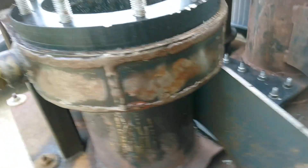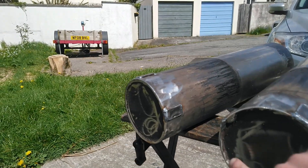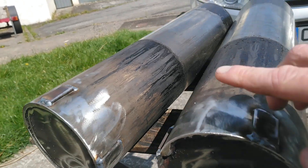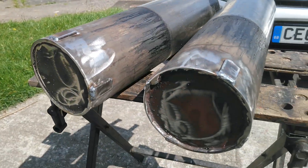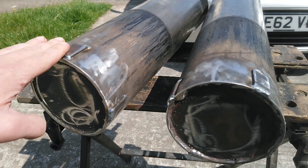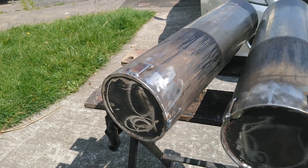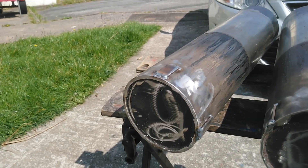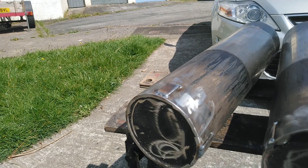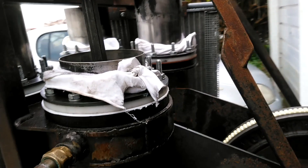I'm going to go ahead and cut these skirts off. I've actually cut the skirts off now - they've been lopped off shorter so hopefully they won't catch in the bottom of the engine. I've also welded these tabs on here. The tabs are to space it off, so when it goes up and down something keeps it in the middle. It's a basic design because they hang vertically so there isn't a great deal of force against them. The problem is the bottom of the engine is so hot - if you put anything more suitable there it would melt. I tried using brass held on with aluminium rivets, but that fell off because of the heat.